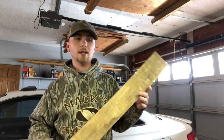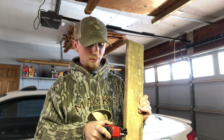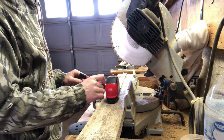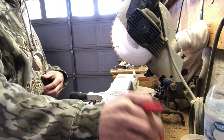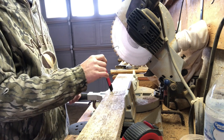This customer wants a specific kind of plaque — one longer board in the middle and two shorter ones on the sides. You can use wood from the store; I use barn wood, just rough lumber. Make sure if you're using multiple boards that they're the same width. I usually make the middle boards 15 inches and the outside ones 13. Measure and mark one board at a time because when you cut, you lose a little bit.